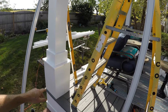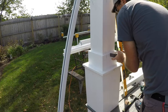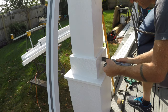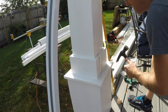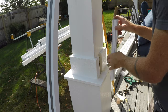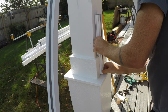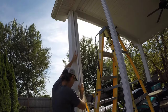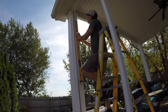The only time things got a little tricky was with these posts. I wanted to hug the post with my channel, so I took my Dremel and cut out some slots. That allowed me to slot in the aluminum channel and kind of bury it in the post. On your porch you may not have that exact issue, but it's an example of how you can make mitered cuts and work around things with a little ingenuity.